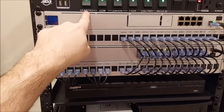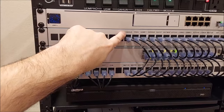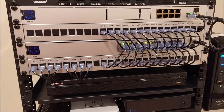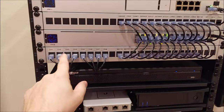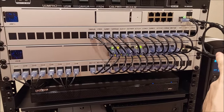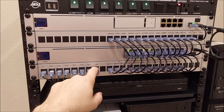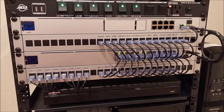Going back up here, you can see I've got labels — white on black, and then these are clear background, black on clear. The cables are labeled as well and cable wrapped, white labels of course. These are all Monoprice CAT 6A jumpers in various lengths going to different components inside the rack. This is a Ubiquiti direct cable, and the SFP ports are interconnected. All of the CAT 6 jacks, the keystones, the keystone blanks, and some couplers in there are made by VCE.